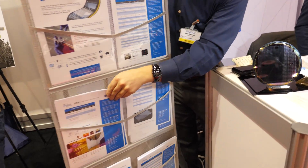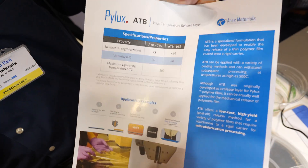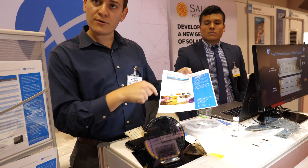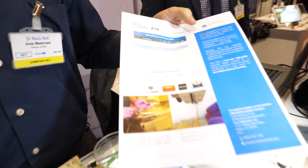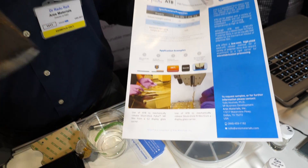ATB is our temporary bonding agent. Whenever you do microfabrication on plastic, you're actually doing it on plastic that's on a carrier — in this case, the silicon. At the very end you need to release the plastic from the silicon carrier. To do that we use a temporary bonding layer that is high temperature capable — it withstands temperatures well in excess of 500 degrees Celsius — and it's compatible with what the industry is using right now, the polyimide films. We use it to delaminate our PILUX films from the carriers.